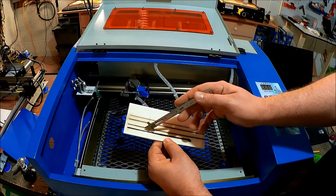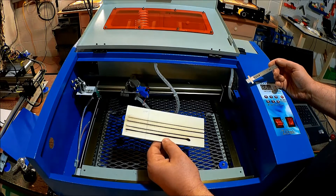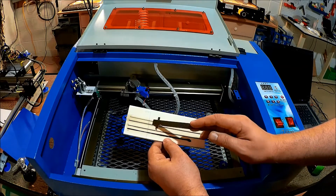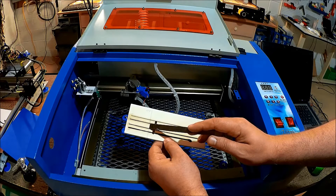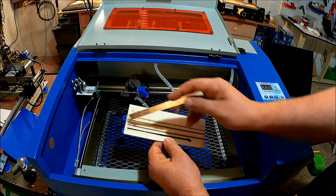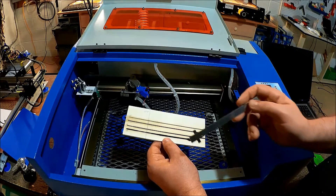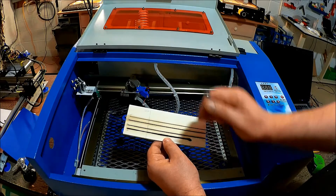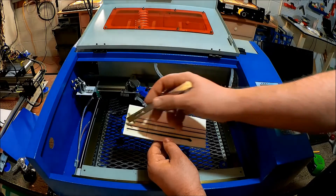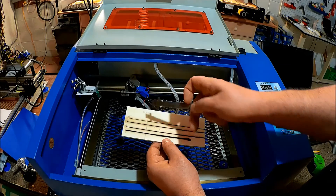Notice the burn rate, because you can go too slow — especially for wood or acrylic, because the acrylic can just keep remelting. Coming up with the optimal of about four millimeters a second seemed to burn through the best, because if you char too much, the charred material actually begins working as sort of an insulator. You can keep running pass over pass and you're not going to get anywhere because of the insulation being built up by the charred material absorbing the heat from the beam.